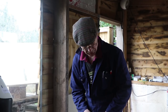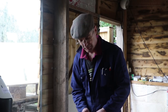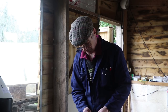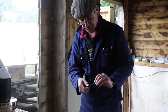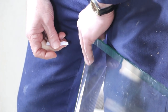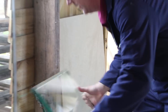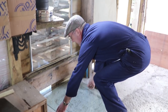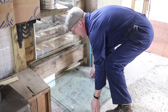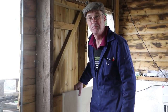Non-combustible material — it has to be non-combustible to go underneath the stove, 12 millimeter thickness. Most of the details you can refer to on the blog. In our case we're using a piece of glass, so just to protect it from the concrete floor I'm using a few pieces of self-adhesive fire rope to stick on the corners, to make sure it sits on something a little bit softer. Then I can put the piece of glass down in the position where the stove is going to go, nice and gently, and there it sits quite happily, ready for the stove to be mounted.